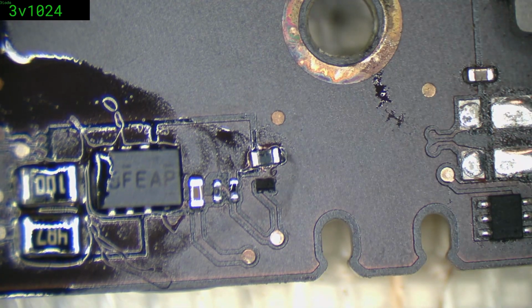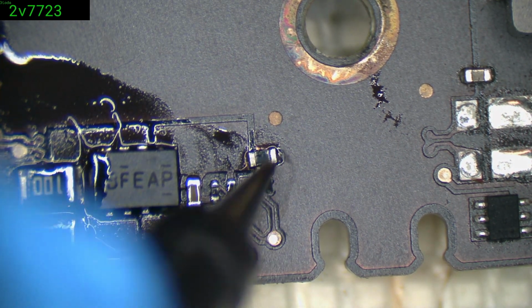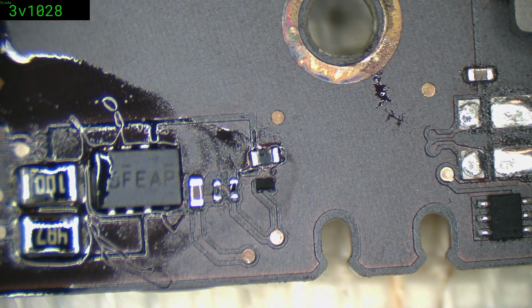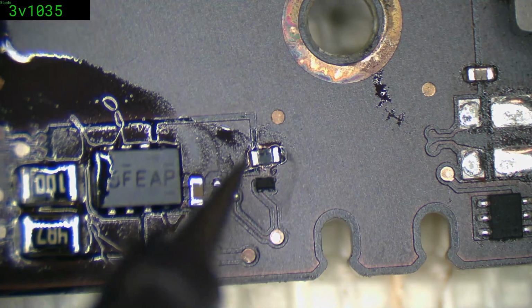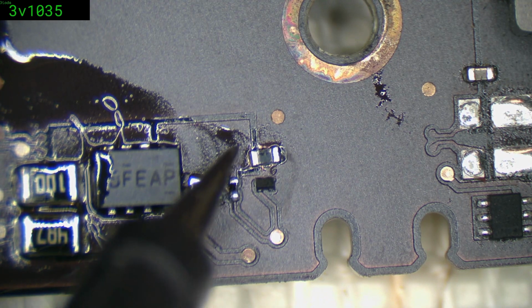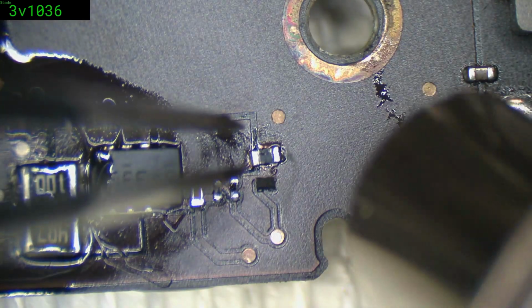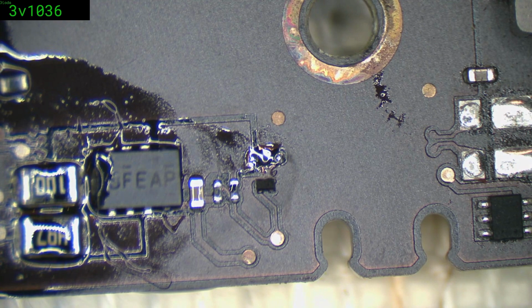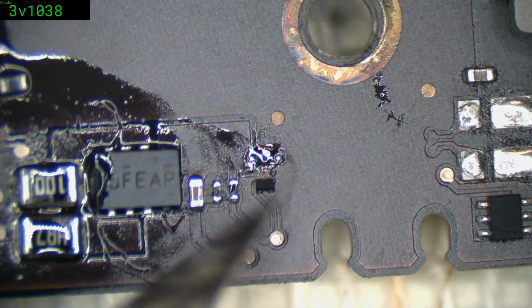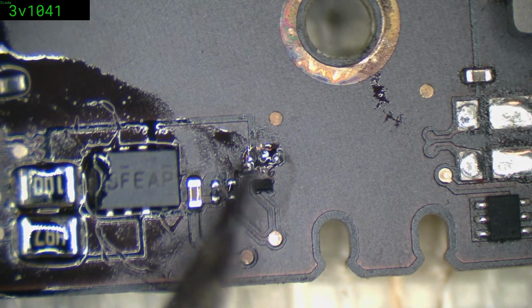Get our diode mode now. Let's see if we get any shorts. 3.1. You're a dead short on that side. Which is correct because you are in fact ground here, whereas this is PPDC in. Look, honestly, given that that's PP, because that's the DC in, I think I will take that off and scratch back. You can just rest over there. The main reason being is we don't really want to short jumping across these points.